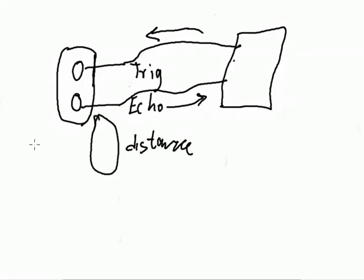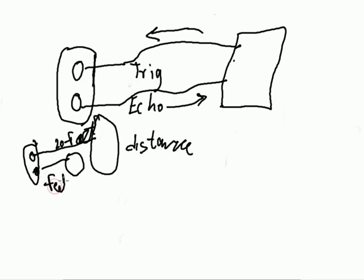So here is your ultrasonic sensor. My drawing is not good. If this object is like 20 feet from the person, we do not care about it. But if this object is very near, like a foot apart, we have to raise the alarm. So there will be an if condition that will raise the alarm for us. Based on that alarm we will trigger both the buzzer as well as the vibrator. That is the whole assembly of the previous project that I had shown you.